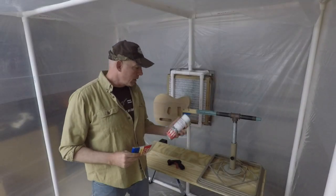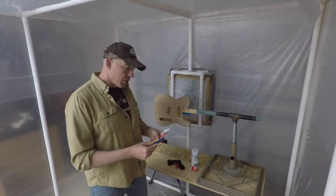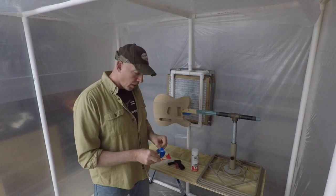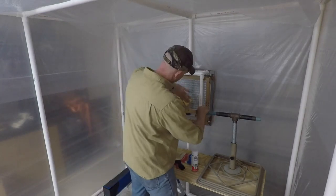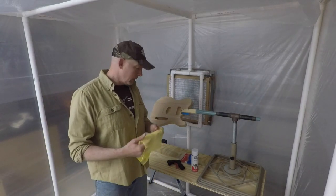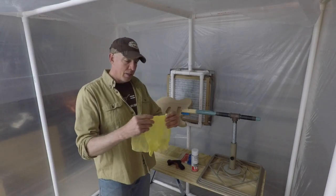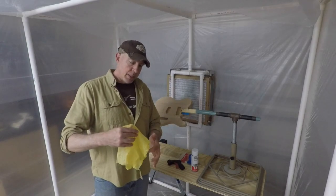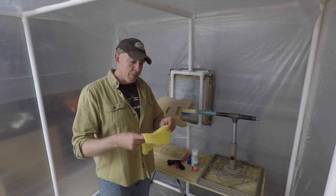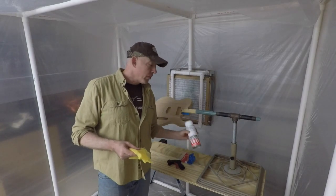Before I start putting my white vinyl sealer on, I'm going to use a tack cloth and get all the dust and any excess sawdust cleaned up. All right, I'm satisfied — got everything off, any remaining dust. I got a little bit of stickiness on my hands from the tack cloth, so I'm going to take some naphtha and clean off the surface, make sure there's nothing left from the tack cloth on the wood, and get it off my hands, get some gloves on, and get ready to spray.